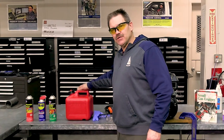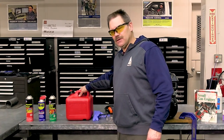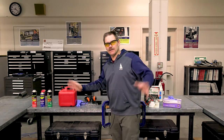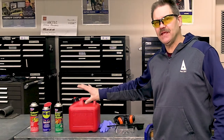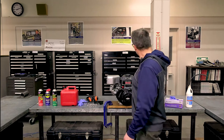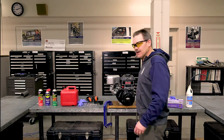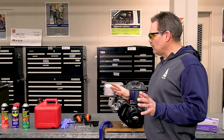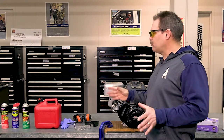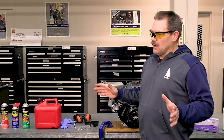Take care of the gasoline — make sure it's safely stored. If the gasoline explodes, it's just a bomb. People are going to get hurt or killed — just don't go there. Safety cabinets here in the shop are behind this door, in the yellow cabinets — sometimes they're red. Make sure that they are not in a place where they could catch fire.